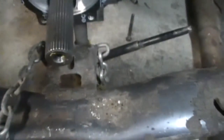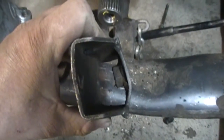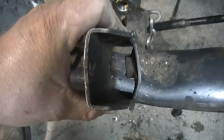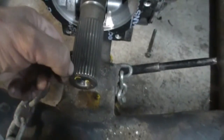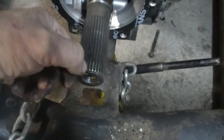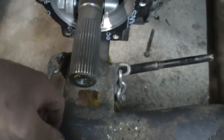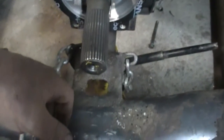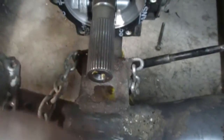I've used this particular mount on three different cars and multiple derbies. Usually end up with a bumper above the roof of the car where you can't see out the front anymore. I've got the tail shaft off right now just because I did break a rear end and spit a drive shaft out — it went in and out a few times and just tore the teeth up enough that the yoke wouldn't slide in and out. Managed to hammer the drive shaft back in for the next year, but you don't typically want to do that.